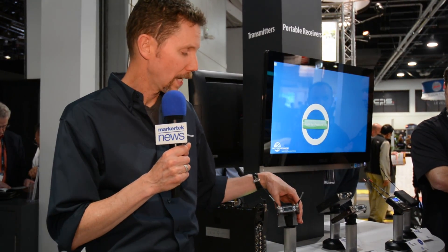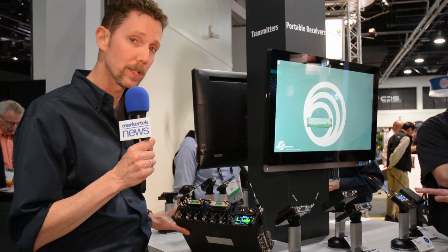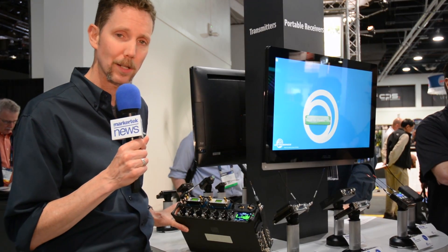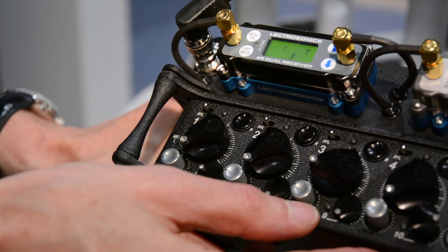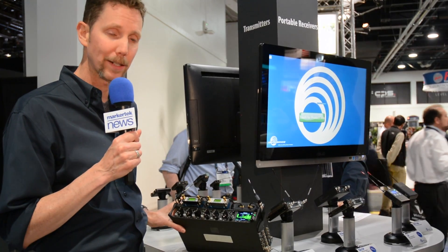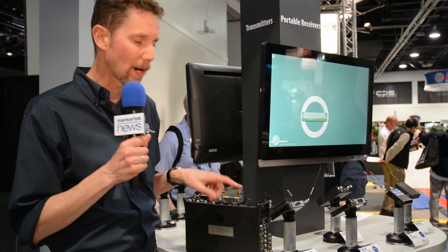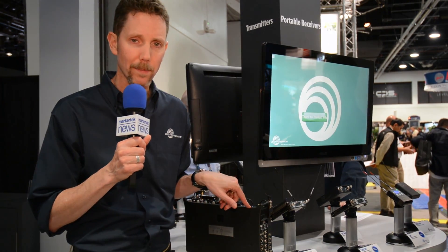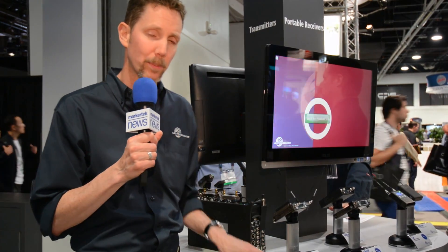The new SRC is also Super Slot compatible. If you've not heard about Super Slot, it's a new docking standard created by Sound Devices. I've got one of their mixer recorders here — this is a 688 with an SL6 dock. We can see two of our slot receivers mounted here and they're completely integrated, so all the wiring is taken care of. There's a data connection that allows you to do an RF scan and then program your receivers right from the menu of the mixer recorder. Super compact and integrated — a very nice, slick solution for production audio sound.